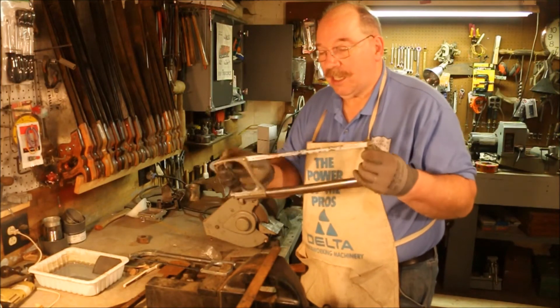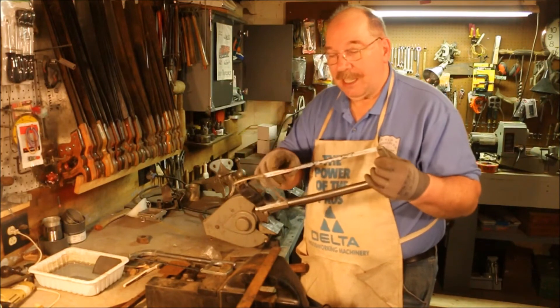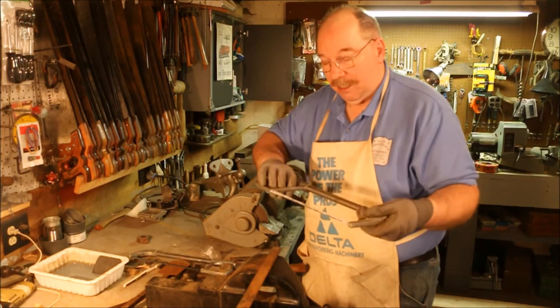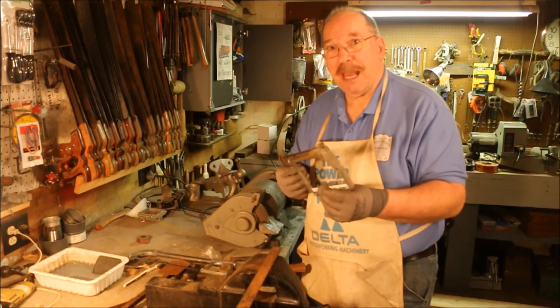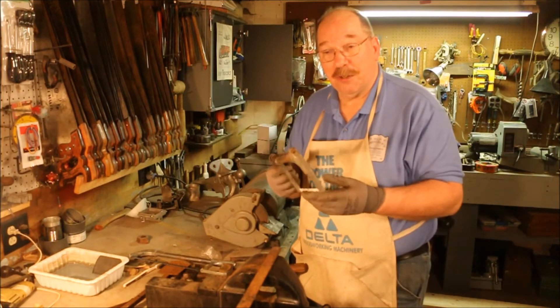You'll notice that after you're done doing that bear-down thing, the teeth are going to be broken off in the back because that's where you're really getting into it. You're overloading the teeth, plugging them, they stop cutting, and then they break off. Also the blade will bend. See any of those things? Back off a little bit. Lighten up. Use the saw. Let the teeth do the work.